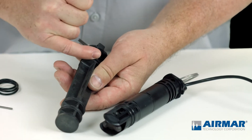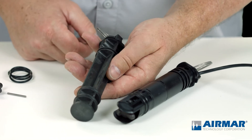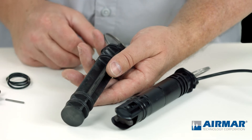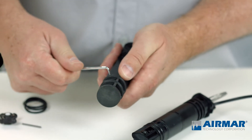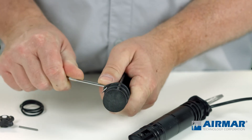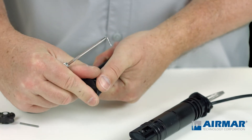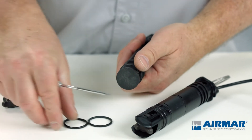I'll notice that there is a blank O-ring groove here at the top. By factory design, it's not intended to have an O-ring in there — maybe in another application, but I'm always going to match it up to what I'm taking out. So pulling the highest O-ring, I'm going to insert my pick tool underneath there, work it out of its groove, roll it off, making sure that the new O-ring matches up.